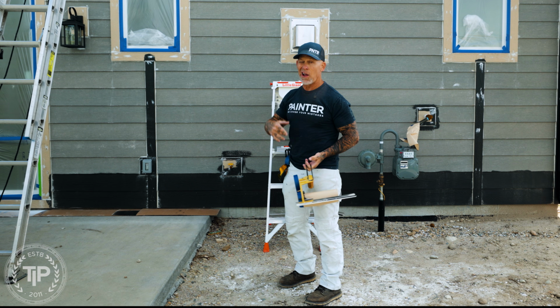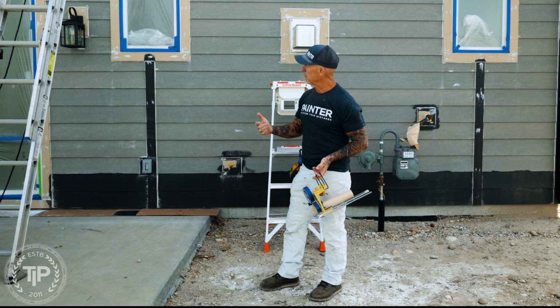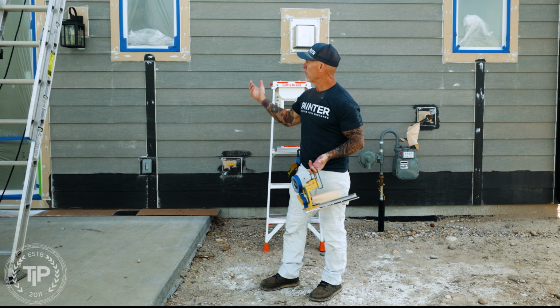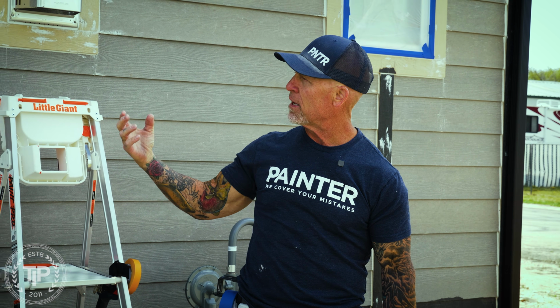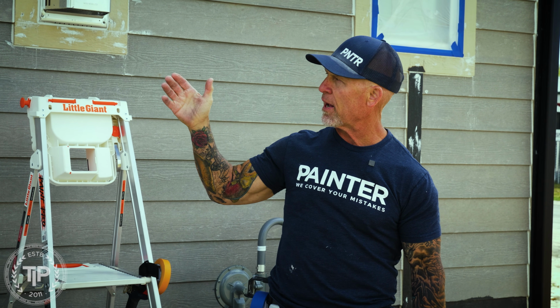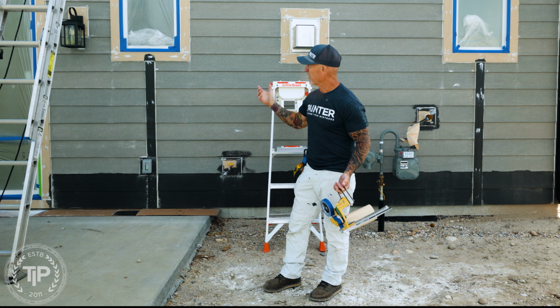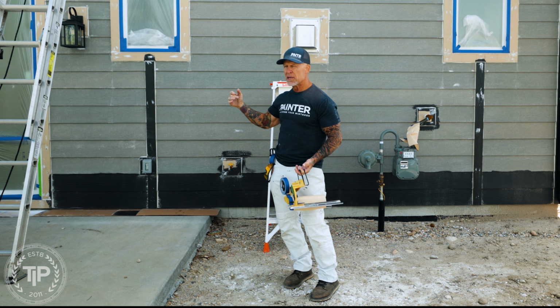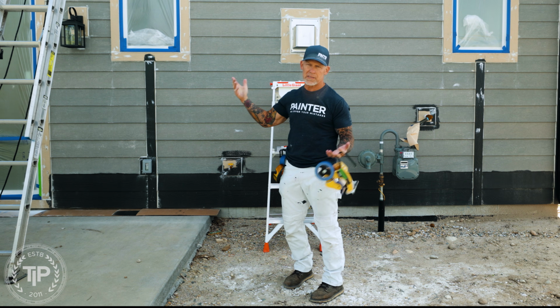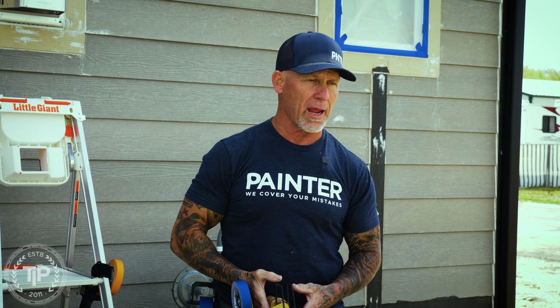We've got lights. Now, I won't say I always remove lights, but probably 95% of the time we remove the lights. One of the reasons is, if the customer changes the light and it has a different fixture plate or anything that doesn't match the previous one, then you've got an unpainted or different colored surface behind that light. So we typically always remove the lights. Exceptions are Ring cameras. We typically don't remove Ring cameras.